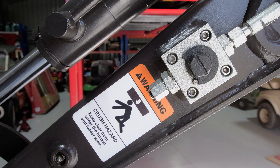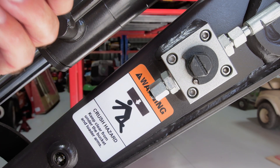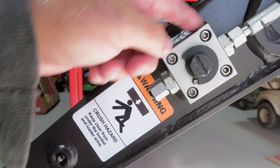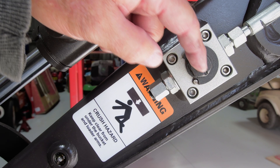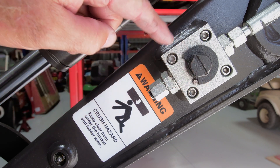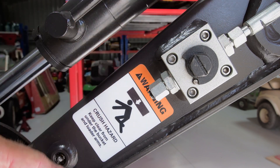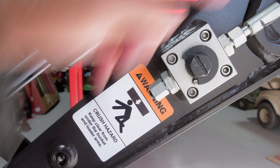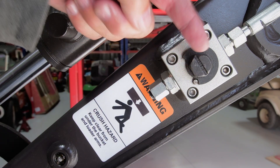If you have a Chinese mini digger then you may find that these valve bodies on this third function are quite similar. I have seen another variety where it actually has the flow control on the top but the body looks much the same. In my case this black control here has a notch in it and basically when it's upright it blocks the flow coming through the valve body. When you turn it and it runs this way then oil flows from the input to the output. So at the minute it's turned off.